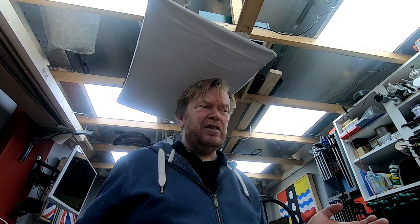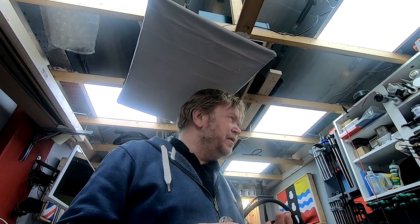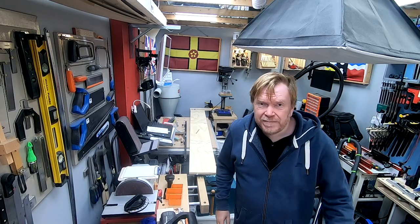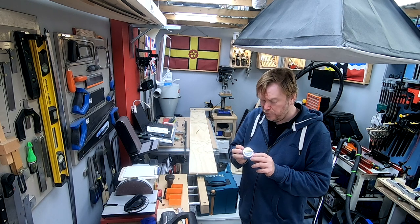Today it's domino joinery. If you start making cabinets, you can start simply like I did with the first cabinets I made for my workshop — just using glue, screws, and dowels for alignment. You can then take the step up and buy yourself a biscuit jointer like I did, and the next load of cabinets I made used biscuits for alignment, making the process of putting cabinets together much quicker.